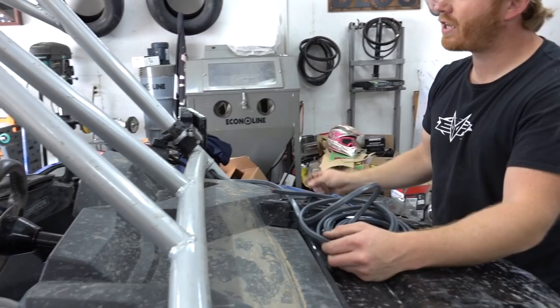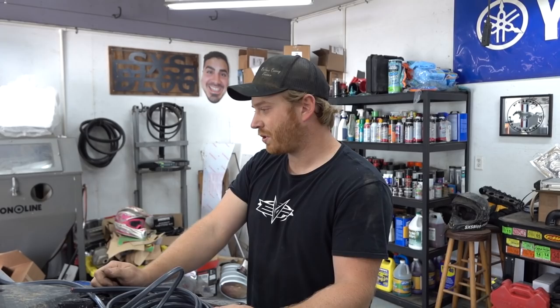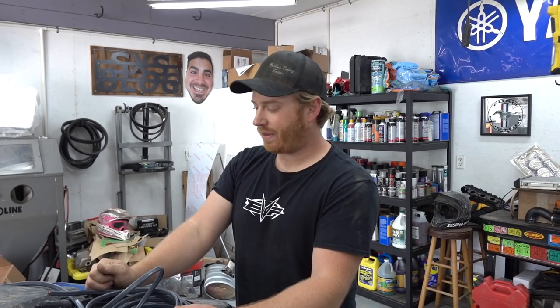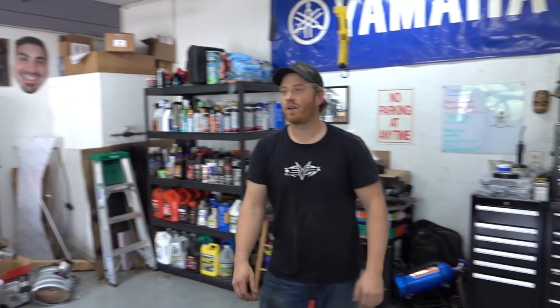I'm not sure whether to go ahead and hardwire in all six lights to a chunk of this, or keep the connectors on each. We could make a harness, but then you end up with a whole bunch of zip-tied-up bundles of wire on the roof. I'm thinking about hardwiring all the lights to this and then putting one connector so you can remove the whole assembly. I'll strip this back and solder each one in to make it nice and clean. There'll be a connector in the corner, wire popping down, going through the fender, with a connector under the cage in case it needs to come off in the future.